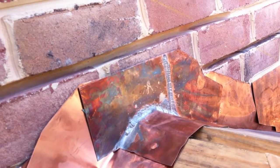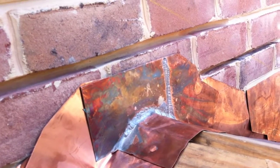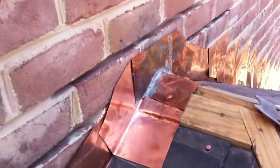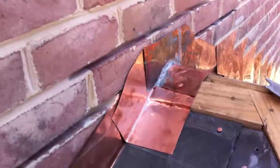It's called a hundred different things — headpiece, top, whatever — just a big piece of counter flashing, just one center piece. But that piece with a gusset in it, this is what makes it watertight. And don't worry about that nail — there's another piece of flashing that's over the top of there because of the type of hip that's being used here.